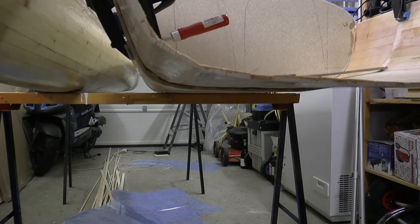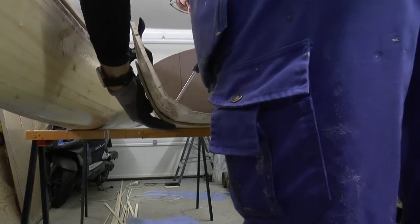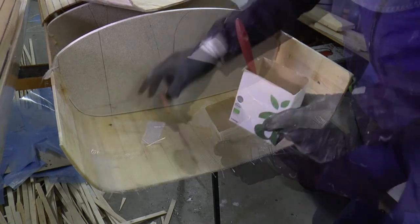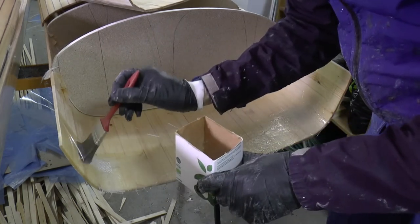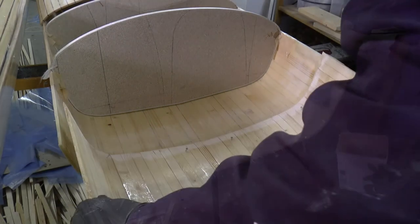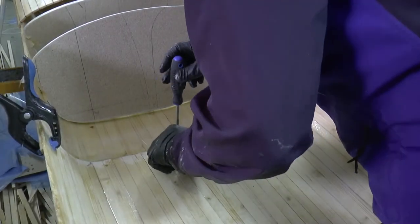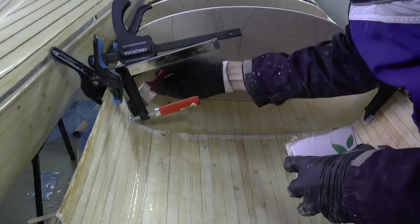Some force is applied with clamps, but the bottom is out of reach and screws are necessary. Some glass will help with bridging the gap. Now the joining. In the bend, I apply more glass. And an extra stroke of very thick epoxy. Before setting the joining in place. The edge gets an extra stroke of thick epoxy.